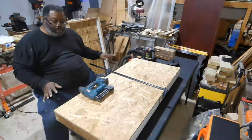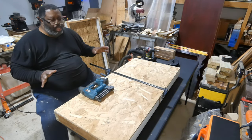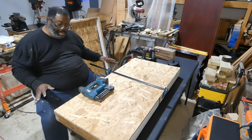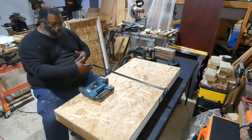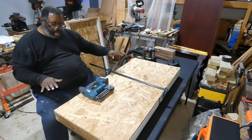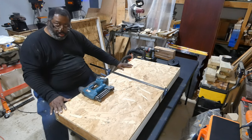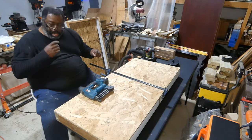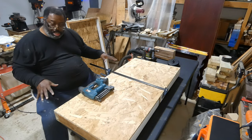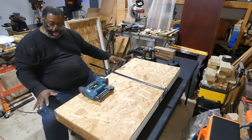Okay, I'd like to note that when you're using scrap wood for any project, you may run into warping. This is why I got the clamp here, because it warps out a little bit, and I got a little uneven point. But as we place down the board, we're going to do a little pressing to make sure the board secures in a certain way that'll help the natural evolution of the board to just flatten itself out.